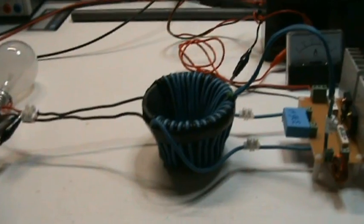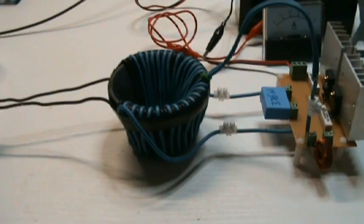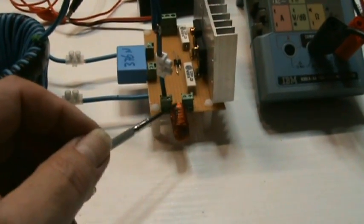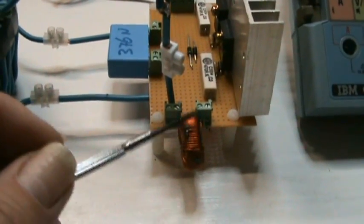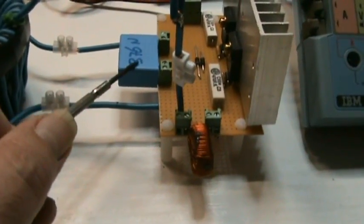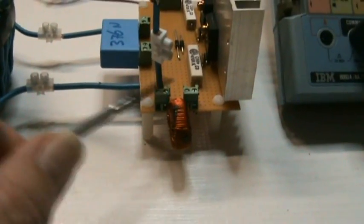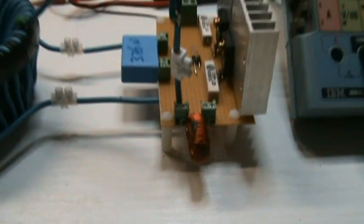Whatever I did, it was 104 volts peak to peak, 9 kilohertz, but whichever caps or choke I put in, it did not matter. I just kept the same low intensity. With this setup here I can easily change the capacitor, unscrewing and putting in another, and the yoke here has 2 connectors, so I can easily swap them around.